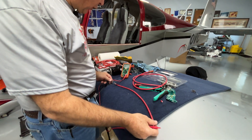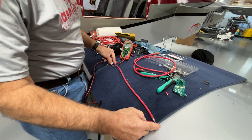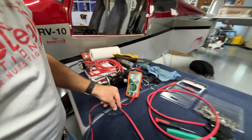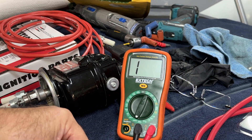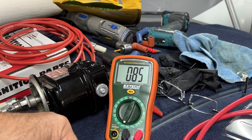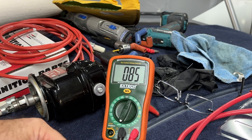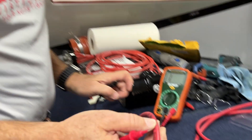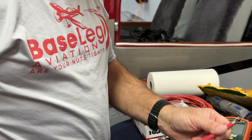Once I've made the wire, before I put it on the aircraft I test it with a resistance meter from one end to the other, just to make sure we have no breaks. You can see we got about 85 ohms. This is about 50–60 ohm per foot wire, and the longest wire you should see with the Lightspeed — if the coils are mounted on top of the engine — is maybe 100 to 200 ohms. Most wires are fairly short so they'll be between 60 and 80 ohms, but I do check them all before they go back on.